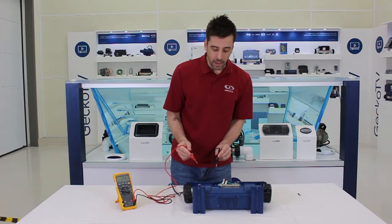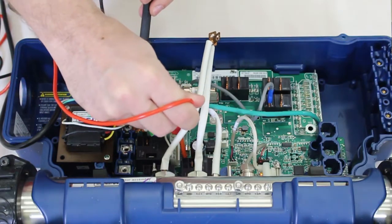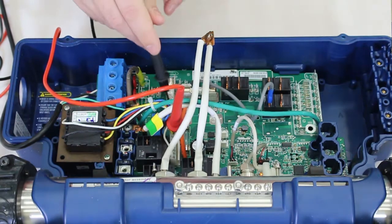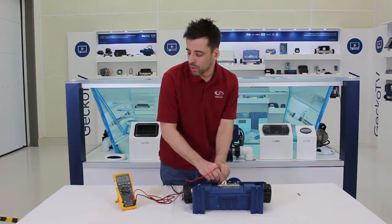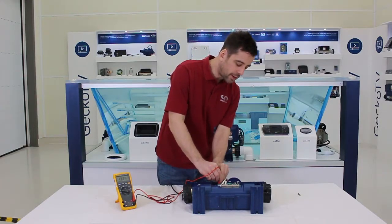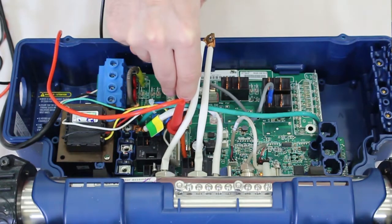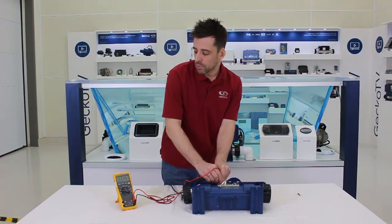On a Y-series pack like that one here, at the secondary, the yellow wire is your common, so you probe the yellow and let's start with the blue, which should give you around 12 volts AC. See here, I'm getting 13. If I keep a probe at the yellow and go to the red, I should get around 10 volts AC, which I'm getting right now as well.